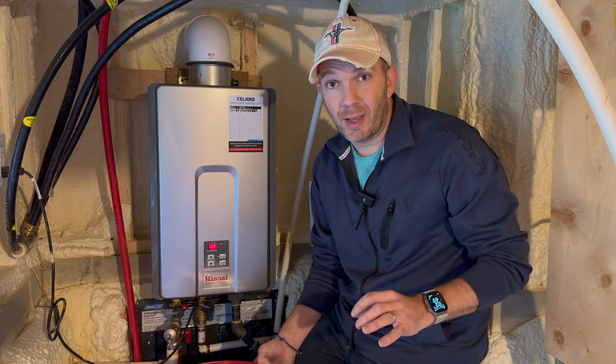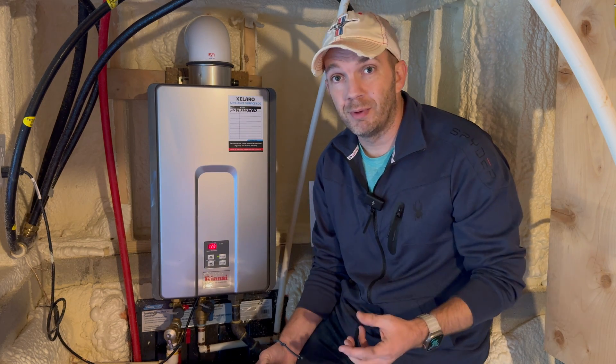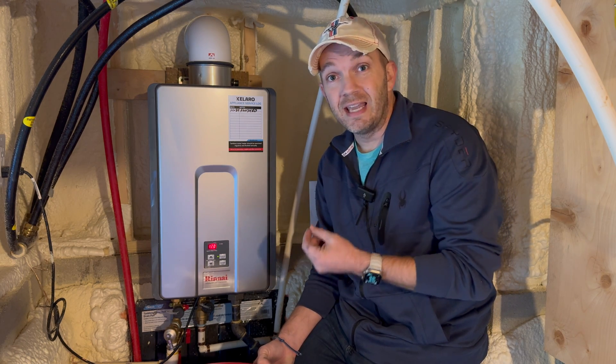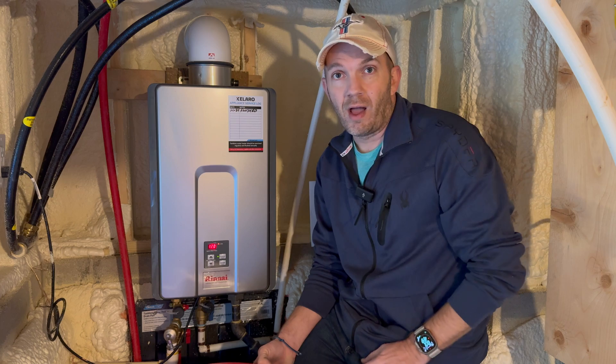It's essential to get the best lifespan and efficiency out of your tankless water heater that you perform routine regular flushes to reduce mineral buildup inside the heat exchanger. Mineral buildup is caused by when water is heated up, the minerals in the water settle out and attach to the heating unit or to other components within the hot water heater.